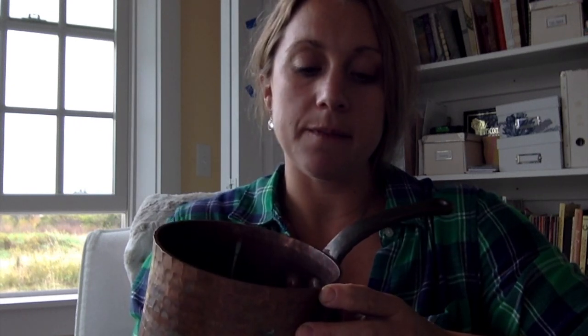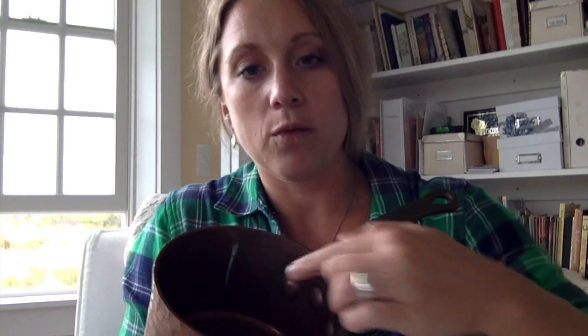First and foremost, I have this piece today. It's a nice old piece, probably French or Italian make — it's not marked, but it's very thick, easily three millimeters. I don't think it was ever lined. Part of the way you can tell is if there's any leftover tin in the rivet cracks or right inside the radius down there. As you can see, it's very clean. Those are the places where tin is most likely not to wear out — it gets stuck there because it's bonded molecularly and receives the least amount of wear. Also usually up around the rim. The fact that this one doesn't have any of those makes me think it was never tinned. I've been asked to tin it now, which is totally fine once I clean it up.